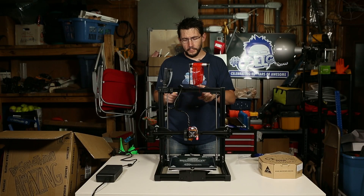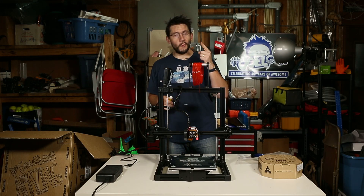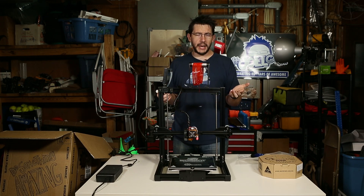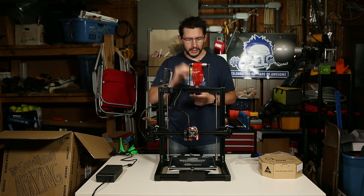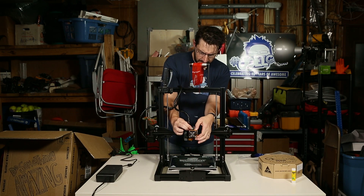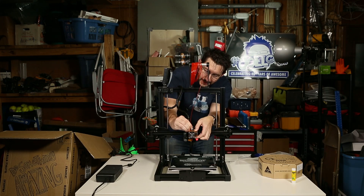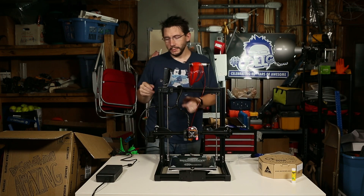All right, we're all heated up and I'm going to put the PLA in. The bed was just bare glass heating up to 60. I'm streaming this right now. Everybody suggested glue or Kapton tape. I had some UHU sticks, which is a PVA glue, and I put that on the bed. Now we're preheated so I can take out this PLA — let's see if it extrudes. There it is! Trying not to hurt myself — this is the place where I hurt myself. If this doesn't work at PLA temps then we know this wasn't PLA, but it's coming through — I'll consider it PLA. Now we send a print.